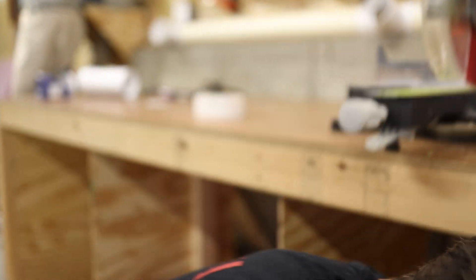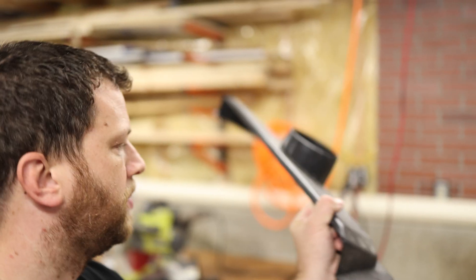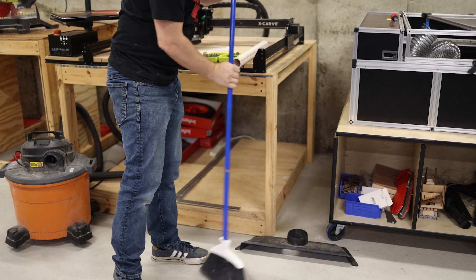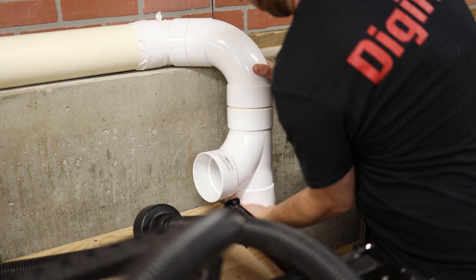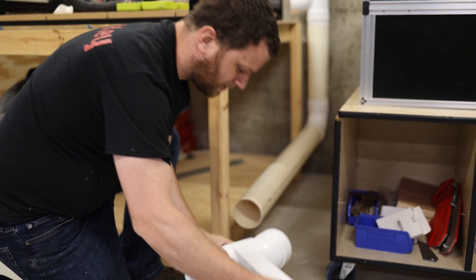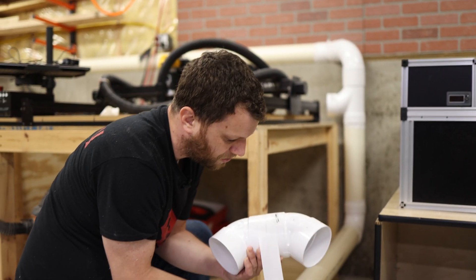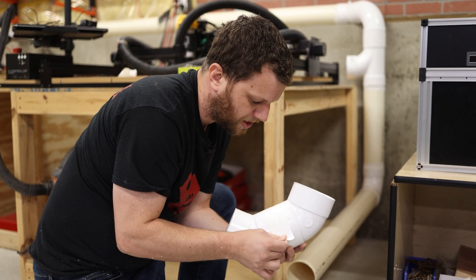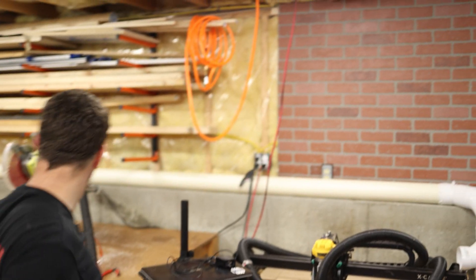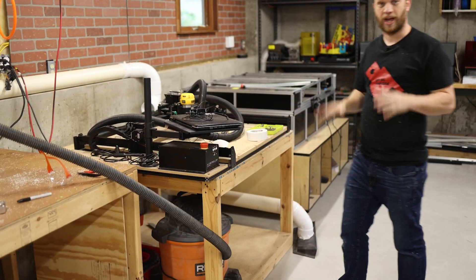I'm considering adding a little sweep-suck-up zone. I have this piece here — it basically goes on the ground and attaches into the dust collection system. It's a little spot for you to sweep into as it sucks up all the debris. That way I could sweep up the shop, turn on the dust collector, and just sweep debris right into there. It wouldn't be that much extra work to add that so I'm going to go ahead and do it. Now I've got all four of my stations: one for the table saw, one for the miter saw and any other saw at this station, one for the CNC, and then the floor sweep which I hadn't originally accounted for.